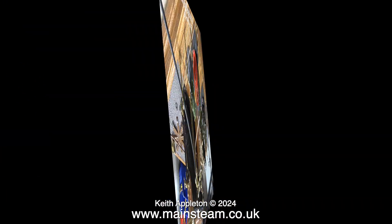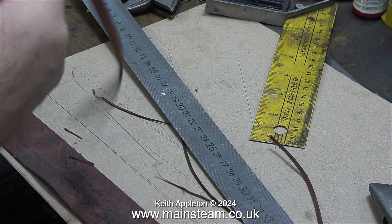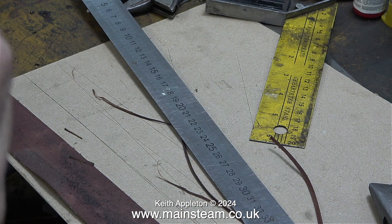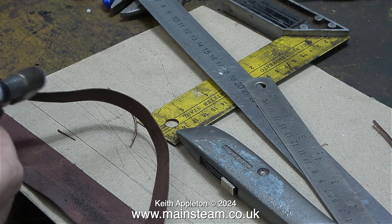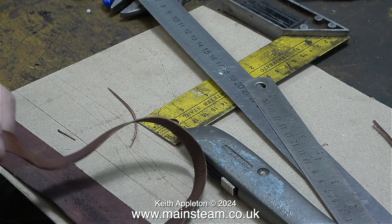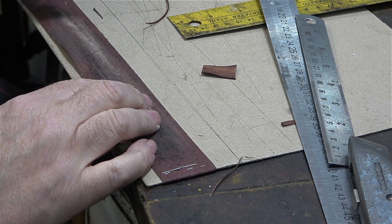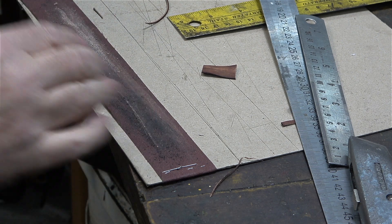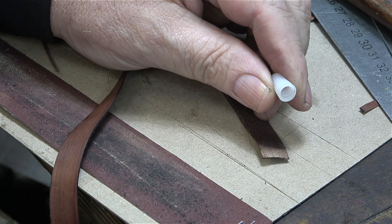The black belt wasn't successful — the day after it fell off. So here I'm trimming down a piece of brown belting, which is really difficult to do. I'd recommend clamping it very firmly before cutting, as it moves around while being cut — and don't forget how sharp the Stanley knife is. I'm chamfering the edges using a piece of emery cloth stapled to card. When chamfering drive belts, it's important to chamfer each end on the opposite side.